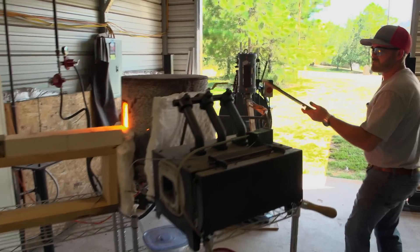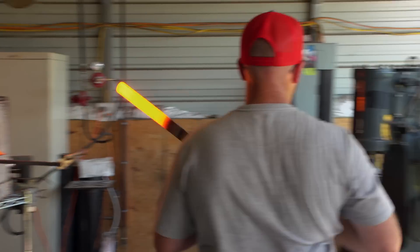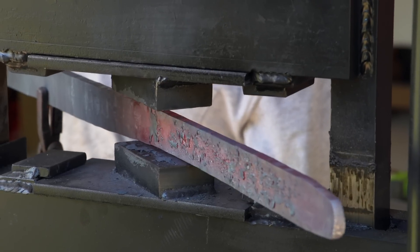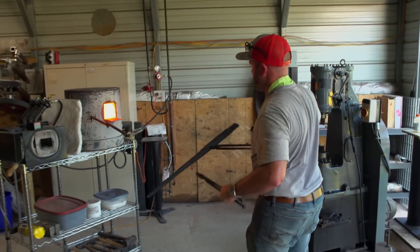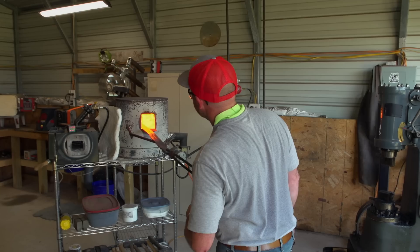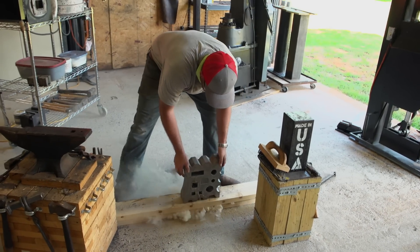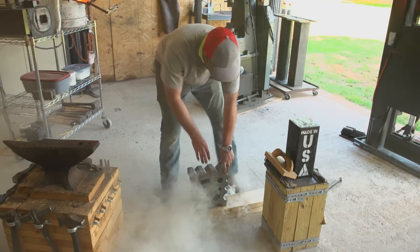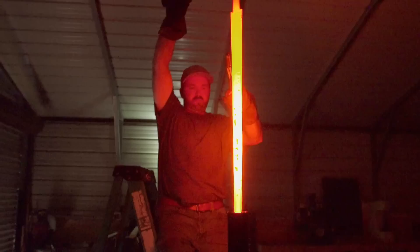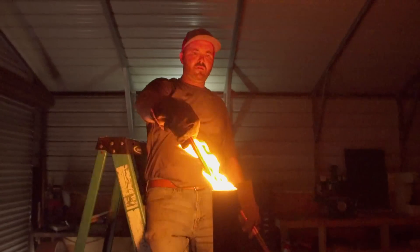We're going to start out with a bar of 1075 high carbon steel. We're going to do a lot of the quick forging to shape with a power hammer. Whenever you try to move a big piece of metal like this, it's quite a challenge to keep it straight. It's getting long and heavy and hard to hold. It's cooling down between a couple of two-by-sixes, so that way it doesn't warp as it cools down. Now we're going to get ready for heat treat. We're getting pretty close to coming up to temperature — about five minutes away and we'll be quenching her. And then my hand cramps and I drop the blade into the quench tank.